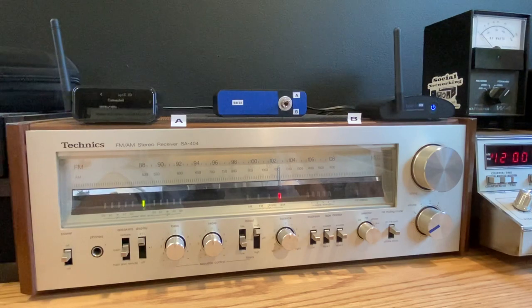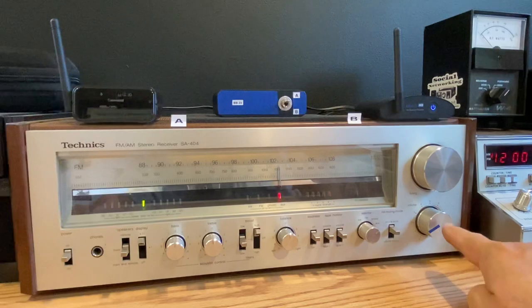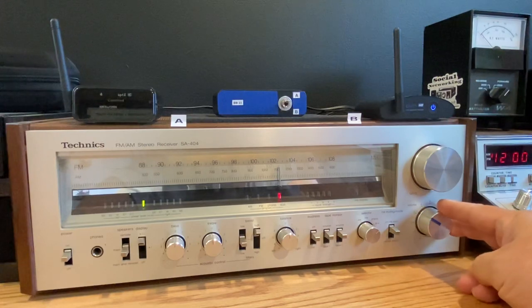What I want to show in this test is something very important to me: RCA output levels. That's why I've marked my little knob here. We're going to use a couple visuals — the LEDs — and do a sound comparison. I want to play some test tones and then some music to show how important it is to have a hot RCA output. This is why most vintage receivers, most preamps, most home stereos in general don't like to be played at high volumes — you're starting to get to the maximum headroom of your amplifier.